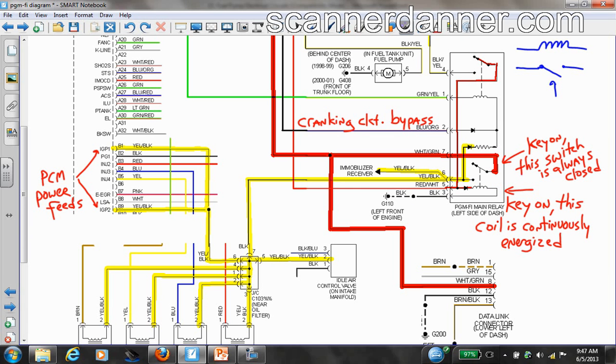There's a diode here — don't let that throw you off. A diode allows flow in one direction (conventional theory: positive to negative) and blocks flow in the other. So is that diode interfering with the power going to the coil on its way to ground? No — it's going to allow that flow. So the diode is essentially not a factor right now; we can treat it as if it's not there.